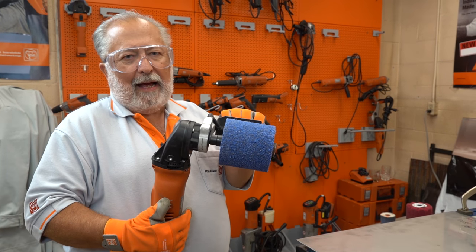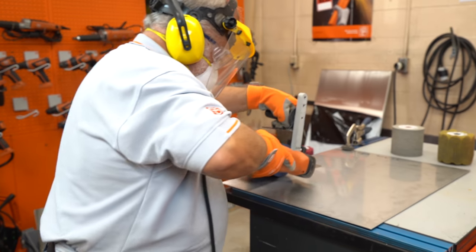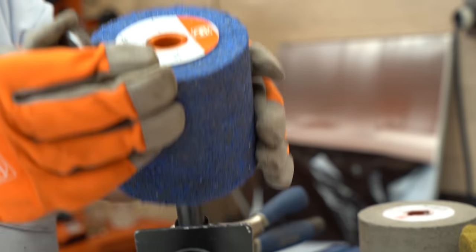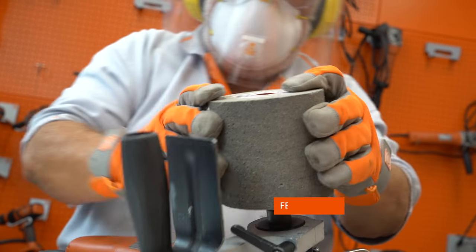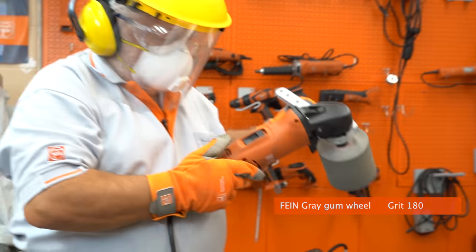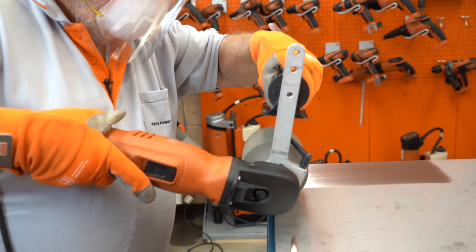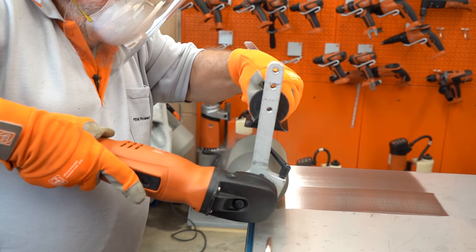I like to run this wheel at about 1000 RPM. You can run it at a higher RPM — up to the max at 2500 — but it's been my experience and preference to run it at about 1000 RPM. Now we're also using another gum wheel — this one is also a 180 grain but from a different manufacturer, and it has a finer grain finish. If you've got stainless sheet with a finer grain finish, you can utilize this fine gum wheel, 180 grain.